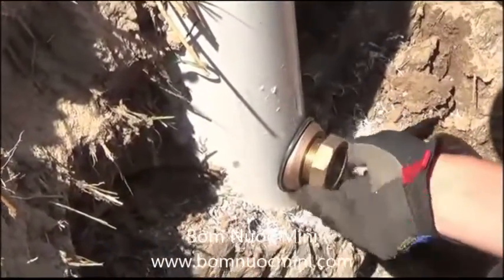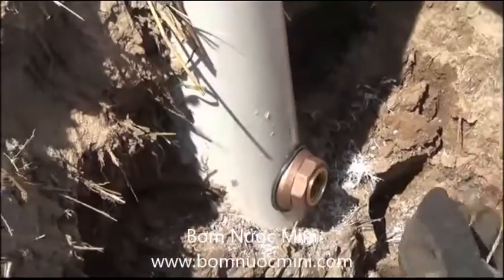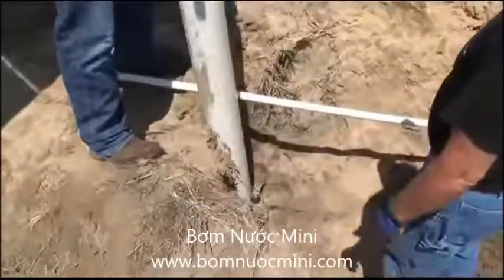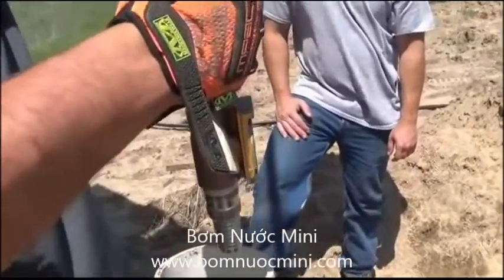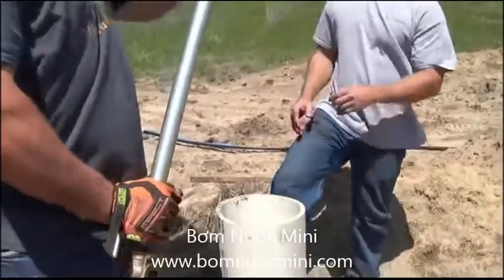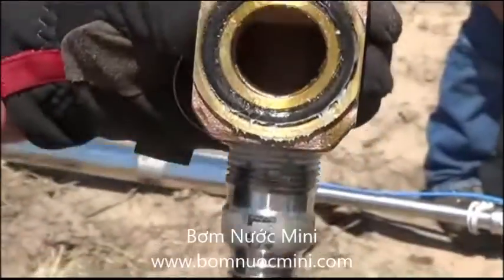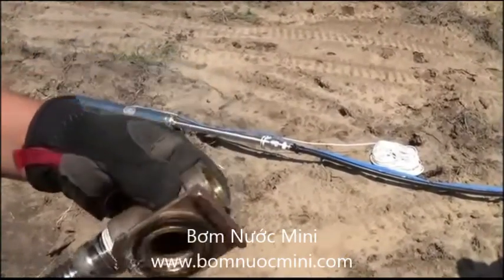Now we'll reattach the outer portion of the adapter. We're going with a one inch adapter and one inch PVC line. We're going to remove the T-pipe, and when it gets to the top you can see the portion of the pitless that remains on the pipe — this is what we'll hook our pump to. As we slide it down, that'll slide back in the slot. This piece will slide down and lock into place in the portion we've already placed in the well. The fitting on top is what you screw your pipe into when you lower your pump down in the well.